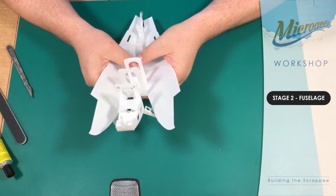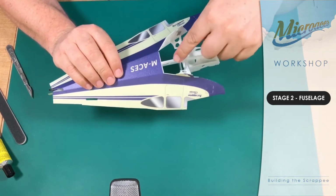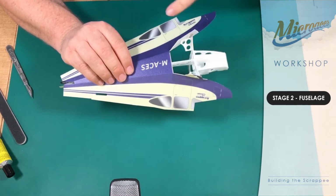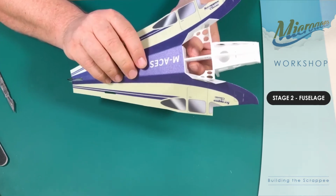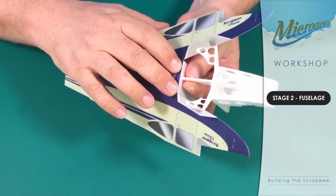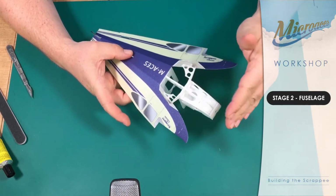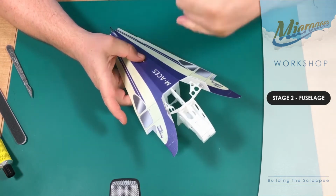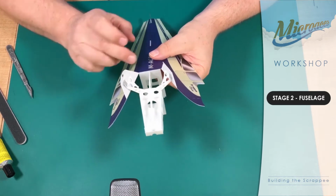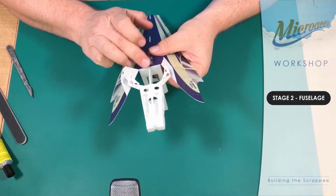go, and we're located. And the one thing we can check now is just here, we just want that skin going around about halfway across the former there. We've got more parts to put on the underside of the aircraft here, and if we have a little bit of a ledge there, that allows us to locate the material fairly nicely on there, and it's supported underneath too.